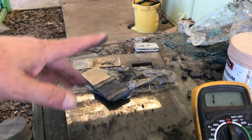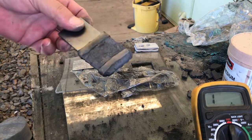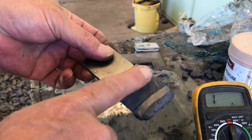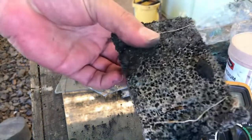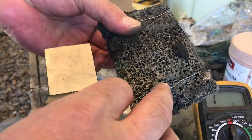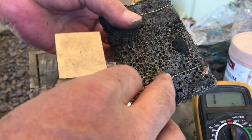I've got another cell running in there - we'll go in in a minute. A good thing about the cement is you can add your nickel oxy-hydroxide into it and it should stay in there as a binder. I'm going to try to flake nickel off an old cell and crush it off and mix it in. I'm also going to try one where I just chop this nickel wire into real small pieces and embed it into the carbon as well.